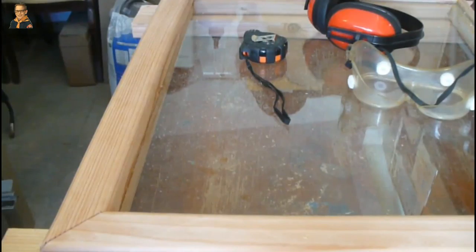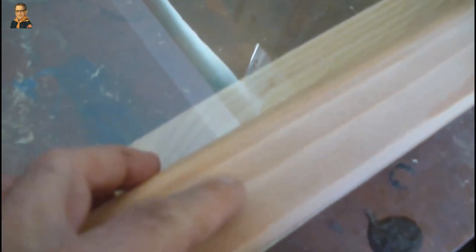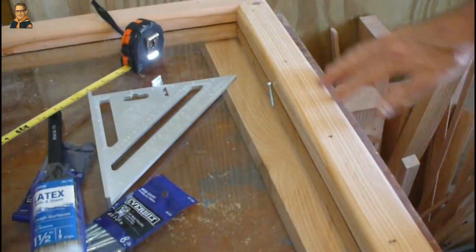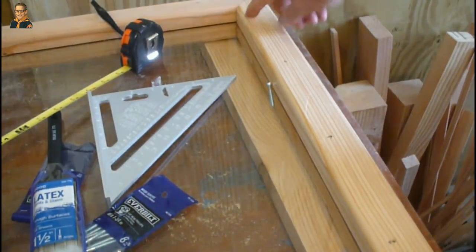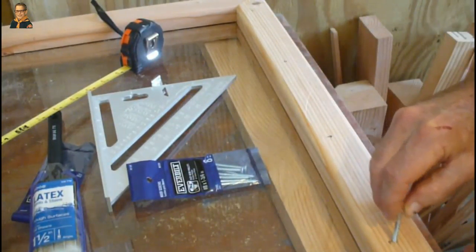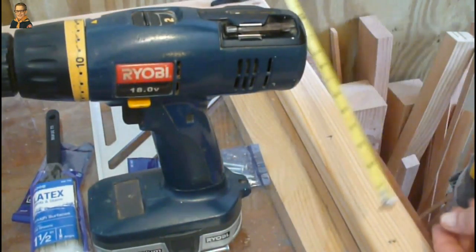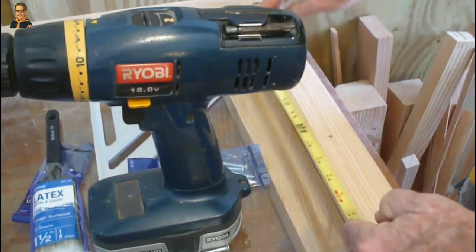I've decided not to spline this because of the glass. The glass is already there and the glass is glued down. Everything here is pretty close to where it should be. So this should be about three-quarter inch. I need four screw holes here, five screw holes here, and five here and four there. We're getting down to the last few little bits. The last thing prior to installation is going to be pre-drill these holes and then countersink them and then paint the wood in preparation — paint the whole assembly. I've got 1-3/4 inch screws, which should be sufficient to go all the way through here. And I've pre-marked these — this one is three-quarter inch away from here.